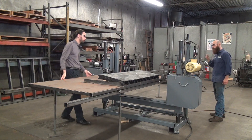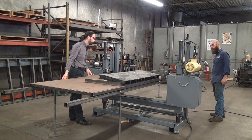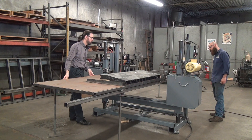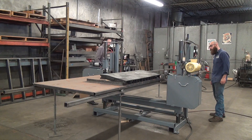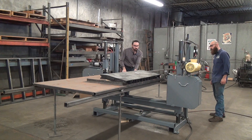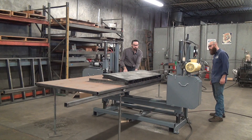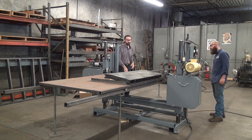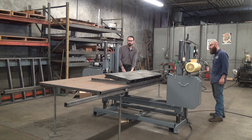Let me try and cut from this side so I can see what's going on. I'm going very slow. The material does not have a constant cross section — sometimes I'm cutting through almost nothing, sometimes through 24 inches of solid material, so the cutting speed reflects that change in cross section.